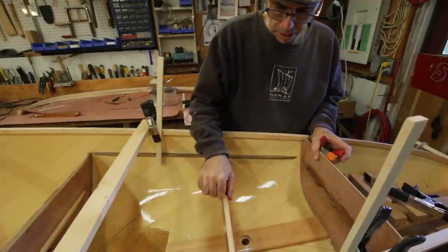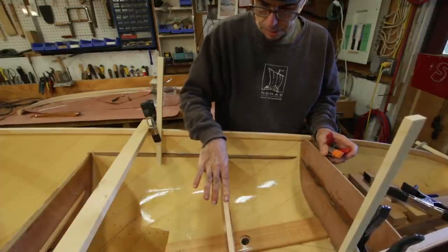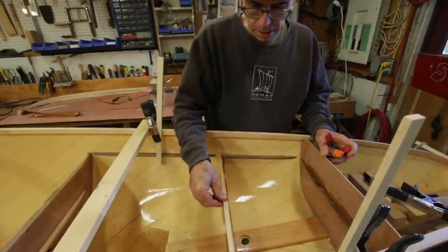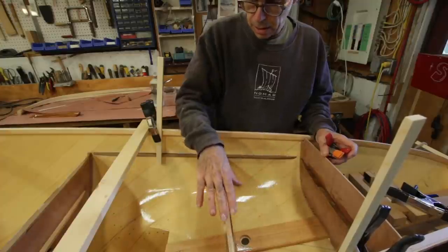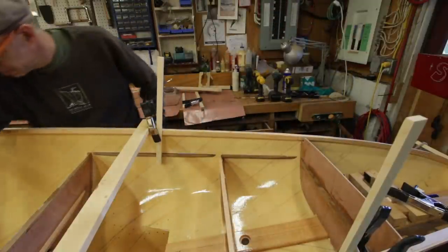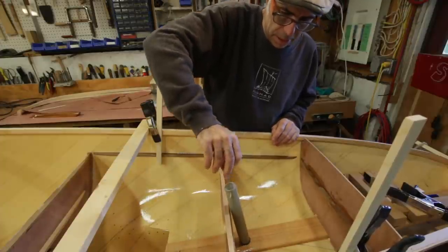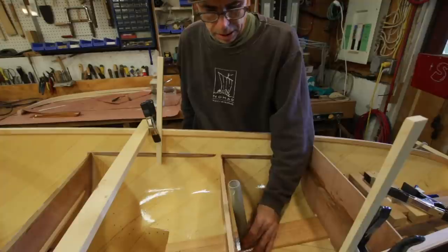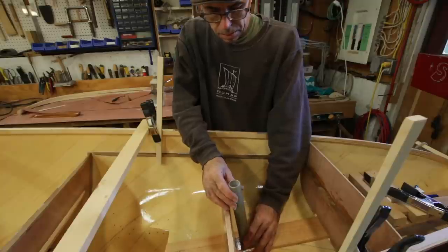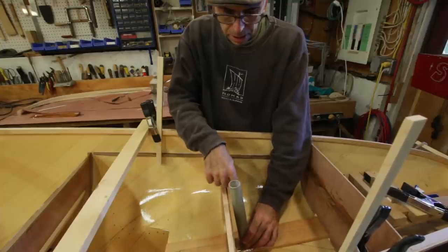So far so good. Things are nice and rigid here. This is going to get plywood all the way across, so this is going to be super rigid now. And even if I didn't put this cleat on, it would probably work pretty well, but this is just giving us a little more gluing area for that panel in there. And I need to think about my rudder tube. That's going to be coming up through here, and what I want to do is just slip my rudder into place and figure out some way to clamp it in place against the hull so that it's perfectly aligned with the skeg. And then I'll slide that down onto it